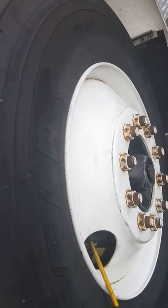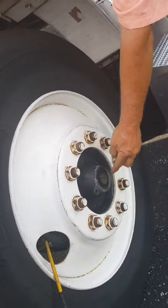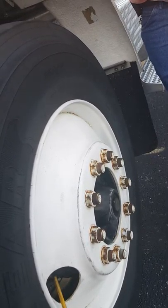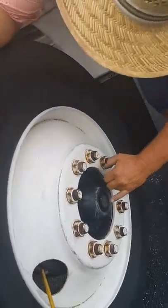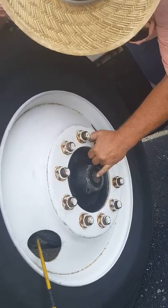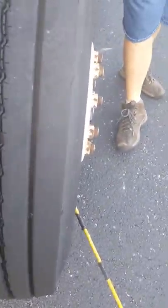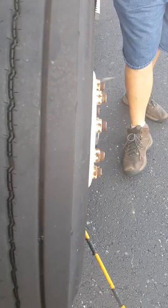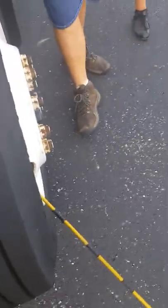It is a sight glass. Those rubber plugs get hard and brittle — when you go to put them back in, you'll usually break the window because the rubbers get hot. There's a very small hole in the center of that hub cap — that's a vent hole to let pressure out as the hub heats up. They will get stopped up with oil, and then you'll start seeing them leak out around there because they can't vent the pressure, so they start pushing oil out around the plug.